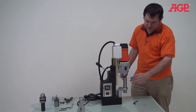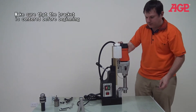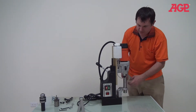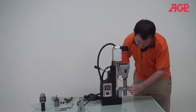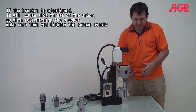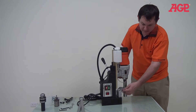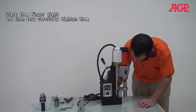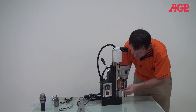We'll load it up and make sure that's nice and tight, then fine tune this adjustment. We want to make sure it's perfectly aligned. It's often a good idea to run the machine — with it running, very carefully and finely snug down these bolts to make sure there's no binding in the arbor support bracket, getting a perfect alignment between the motor head and the arbor support bracket. Be very careful during the final tightening and make sure you're avoiding any binding.